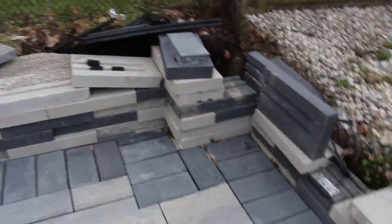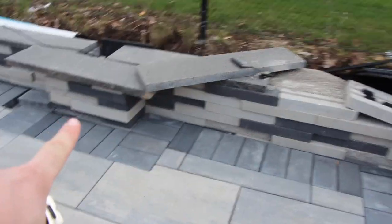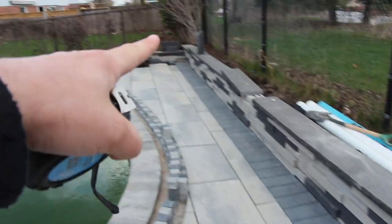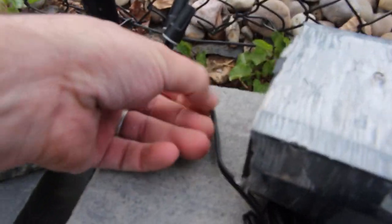What I want to talk about today is the actual design — how we came up with it, what we're trying to do, how we're going to eliminate as many hot spots as possible, as well as play with textures and shadows, but most importantly our spacing from one light to another. You can see we've got two lights here; I skipped this pillar because this light is going to shine onto it, and we have one cutting the distance between these two pillars in half, which will also shine on that one. I have one on the pillar, then five on this wall, and two on that back wall.